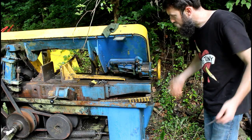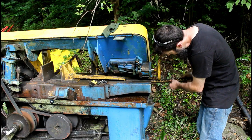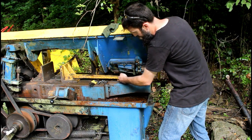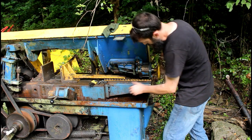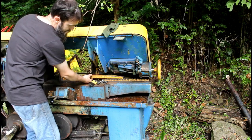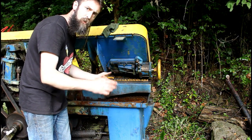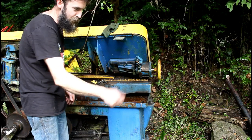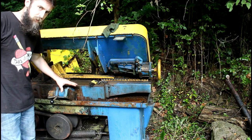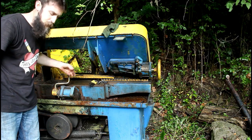That's actually pretty basic design, really. This has notches in it, slides in a T-slotted groove. This has a hook that hooks in that, and anything that pushes on this closes the vise jaw. So it's a quick adjust for sure. You just lift that up, move it, and so you don't need much throw on a handle at all. So a small amount of cranking will close this vise at any position, which is a good design. I just need to make something that's manual instead of something that's air actuated, I guess, or hydraulic.